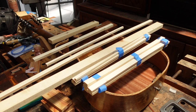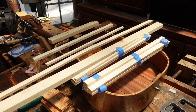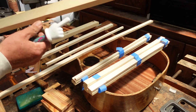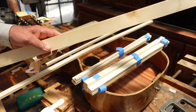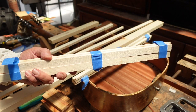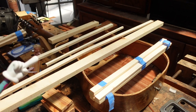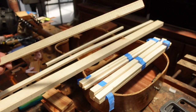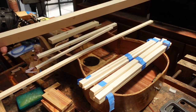Let's get to work on some bracing. Quick look at some materials — check episode 2, link up there. We took some big 16-foot long pieces of spruce — not luthier-grade, but it's spruce with a few minor imperfections, nothing significant. We cut it down and ended up with a couple of bundles that I taped together so it doesn't warp. These were for the bigger braces going across, and then I cut smaller ones for the braces on the bottom of the soundboard.